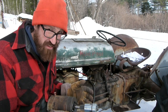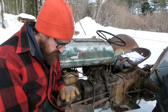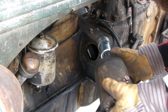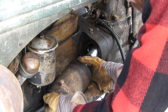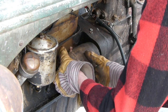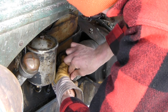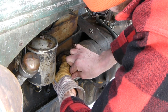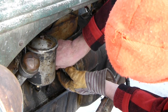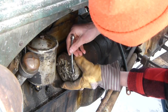I'm going to demonstrate how easy it is to install one of these starter motors. If you ever end up doing this yourself, just make sure these bolts are clear — they'll pull apart easily, but all these springs and bushings won't go back together easily, so it's very difficult. You just kind of slide it in, gently get it past the flywheel, and it should just line up like that. Then hand-tighten. On mine, it's a 7/16th for these bolts.